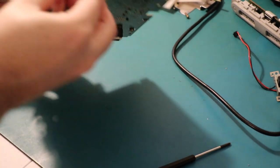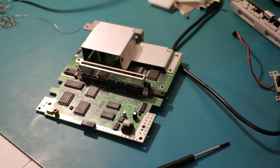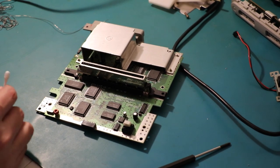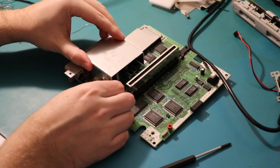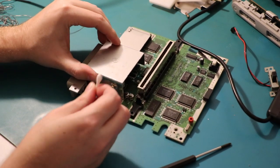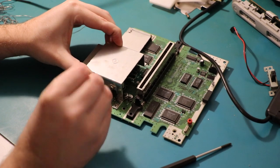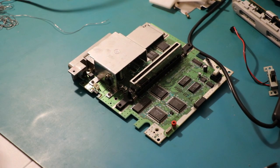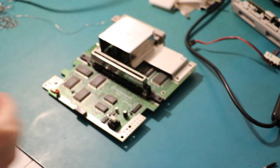Realize you put too much thermal paste in? Go get a Q-tip or cotton tip. What do they call them? Cotton tips. Pure softness, but that's not why we're using them. Could be using a bit of glass, but this is much more convenient than a shard of glass. Just wipe away the excess. And then I think we're good to pop it back in the case and give it a power on.